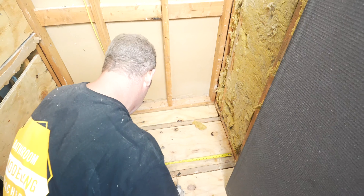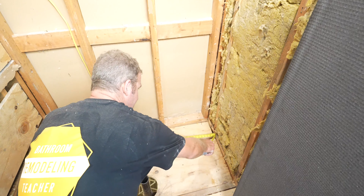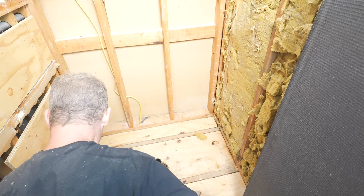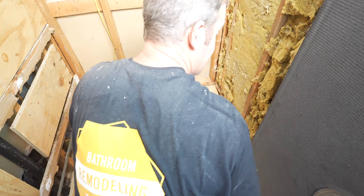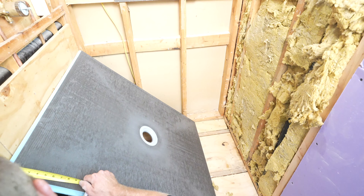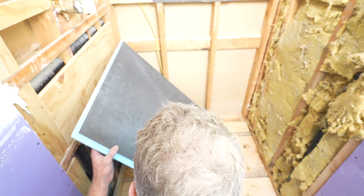On the one side, we're just going to be cutting a little bit off of the left side — basically a half inch. So we're only going to be cutting a half inch off of this, which is primarily the dado joint. We're going to have to recreate the dado. That's simple enough. Let's just cut the dado — or the rabbit joint, I should say — off, and then dry fit it.